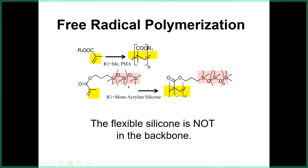The polymer's here. And we've shown in several publications over the last few years, if you use a di or trifunctional silicone, you can really help that. Even a urethane silicone hybrid gave improvement. We've been able to get this up to about 50% with these systems, but still nowhere near the 300%.